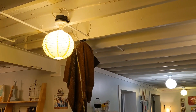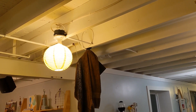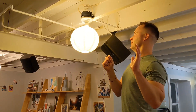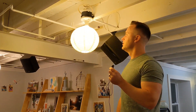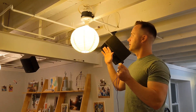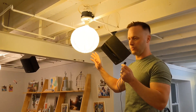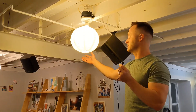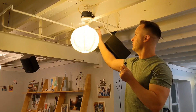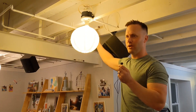That was not good. Lesson learned: if you open up all your faucets to let the cold water drain out, when you turn the cold water back on, it's also going to turn the hot water back on. And if all the faucets are on in the middle of hot and cold, the hot water is going to flow into that mixing valve and flow down the opposite way of the cold water — which is why this was coming out. If anything was in there, I flushed it all out, so this is completely clean now.